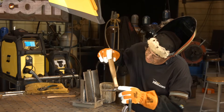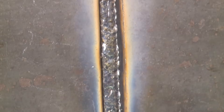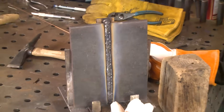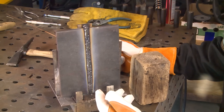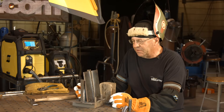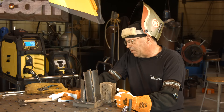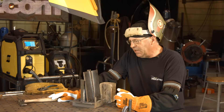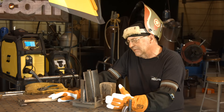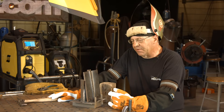That wormhole porosity condition I was talking about is right there and right there. I hope that's the last time I see that on this run. I'm not alarmed with it in that first pass — I plan on filling this up and consuming it, and I hope this condition gets better. If I need to make a value change, I'm going up in volts and wire feed speed. I noticed it was kind of popping and shaking at the end of the wire. I like to run this stuff where it's just a smooth sizzle. This roll of wire has been out in the shop on a machine for a couple of months — the students have been running it, so it's probably absorbed some moisture. I'm going to let this cool for just a second and come back and run a fill pass.